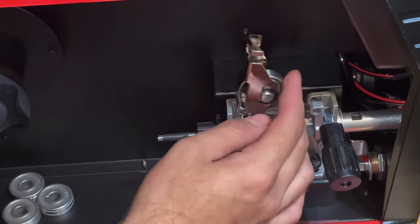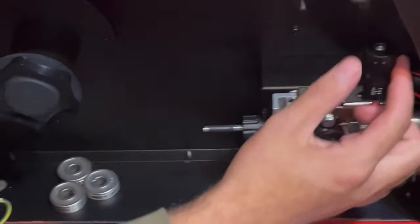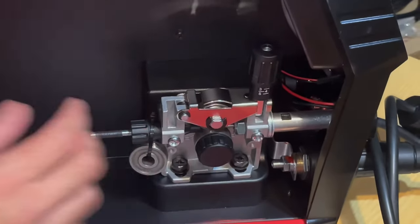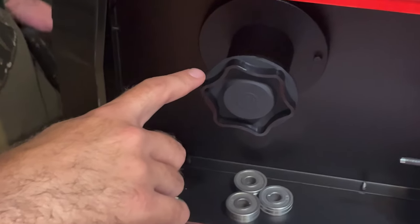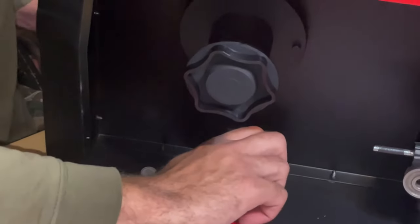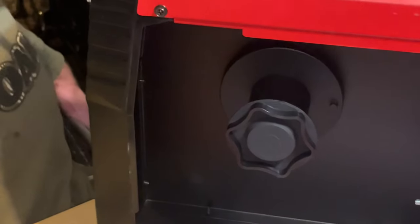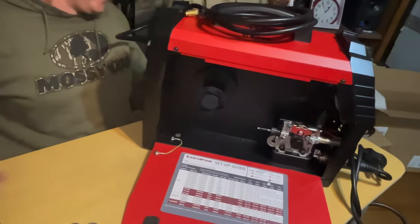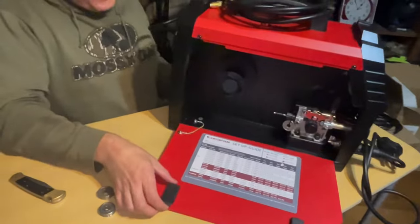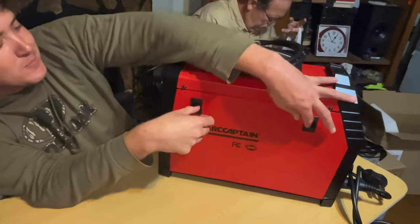This just flips down and the roller goes in here. This adjusts for roller tension. The machine can take a 10 or 11 pound spool of wire, or a two-pound spool. We have the two pound because at the moment I'm probably not going to be welding a whole lot — at the ranch we have other pressing matters. But I am going to start practicing. Please join me, sound off in the comments, tell me what I'm doing wrong. I have broad shoulders — I can take it.